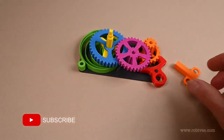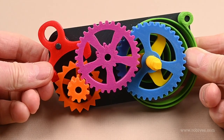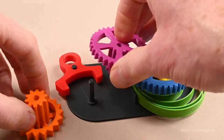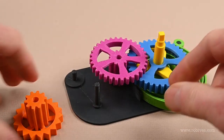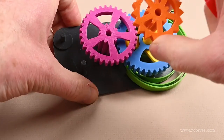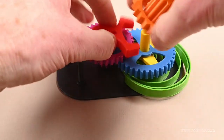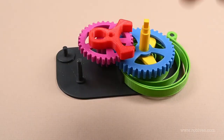So we've got all the parts spread out, but I reckon it should be possible to make the whole thing a lot more compact by stacking everything. I should be able to move this gear into that position there, and then the escapement fork there, and then everything will be packed much closer together. Then I put a lid on it and that's my clockwork motor.